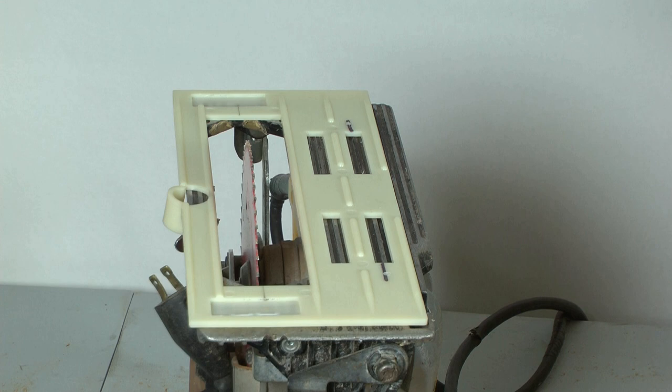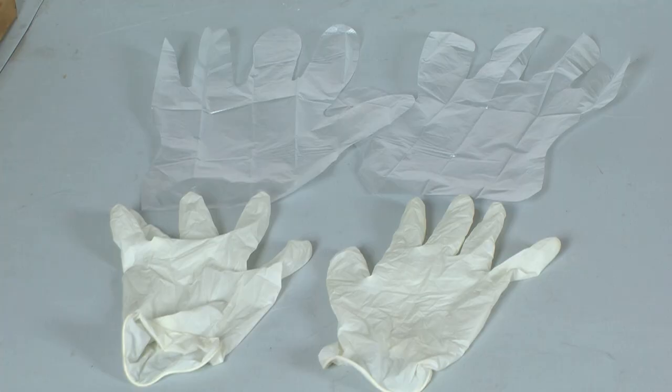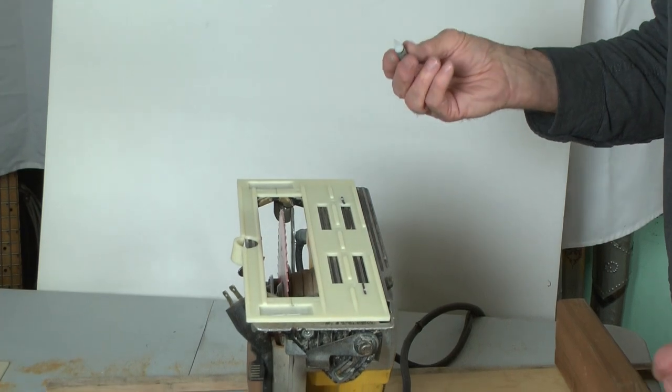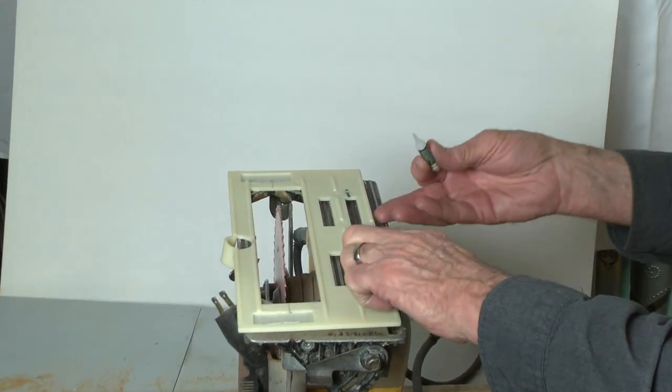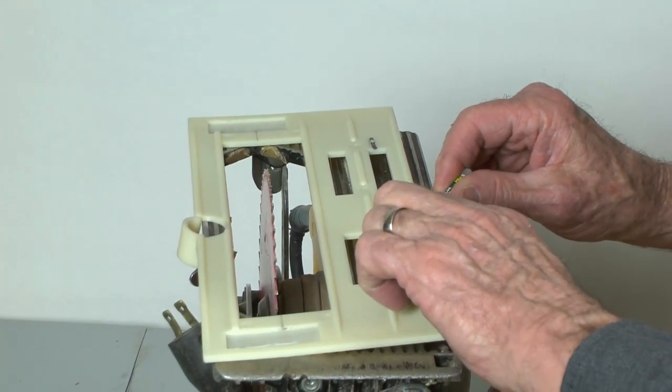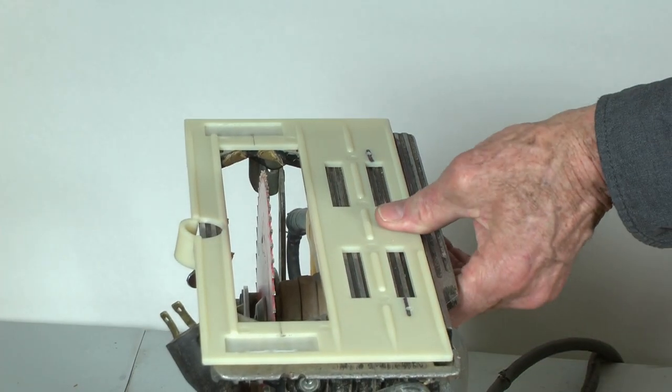Place the saw upside down in a stable horizontal position. Super glue bonds to skin on contact, so you may want to use vinyl or latex gloves for application of the adhesive and follow the manufacturer's directions if glue does contact skin. Lift the edge of the saw guide up slightly and apply a dime-sized drop of super glue to the base of the saw, then press down and hold or clamp down the edge of the saw guide until the glue cures.